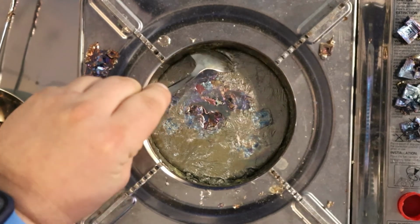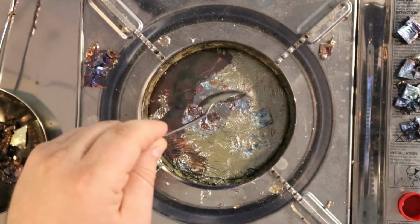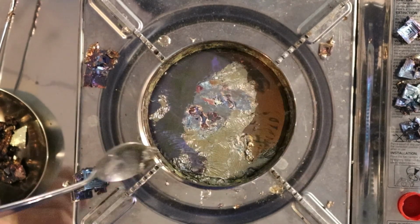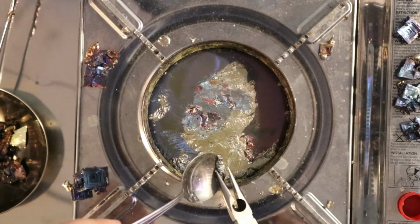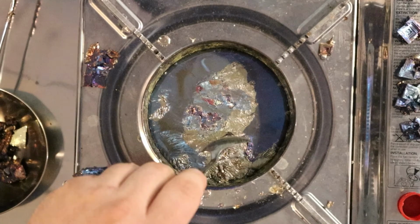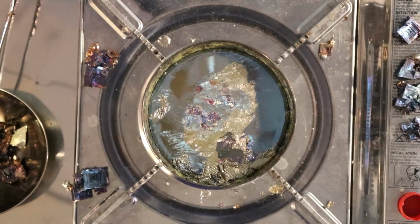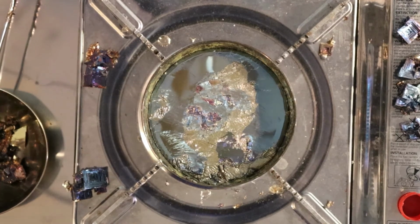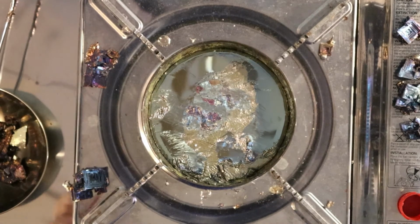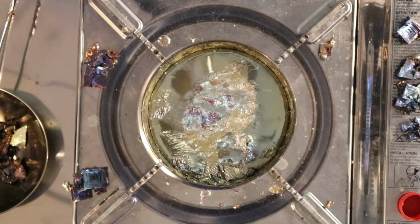See what's happening around the edge. Yep, okay, so everywhere that these crystals aren't is quite hot. It won't take too long to melt this. And just keep some of the slag right on the side. It's tempting to let the slag build up, but it will just get thicker and thicker. To some extent, it will inhibit more slag from happening underneath. But I'd still usually rather see what the crystals are doing themselves. But it looks like now we're totally molten anyway.